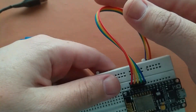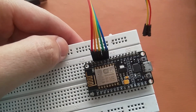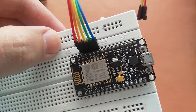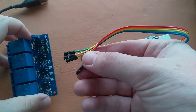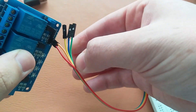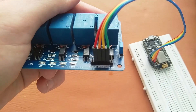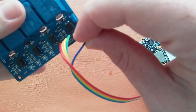The red wire is connected to D1, orange wire to D2, yellow wire to D3, green wire to D4, and the blue wire to the 3.3 volt pin of the NodeMCU. I will connect D1 to N1, D2 to N2, D3 to N3, and D4 to N4. I have connected the pins and the 3.3 volt pin will be connected to the VCC of the relay module.